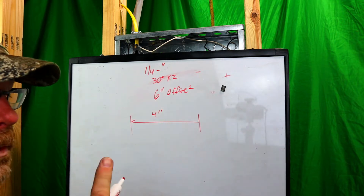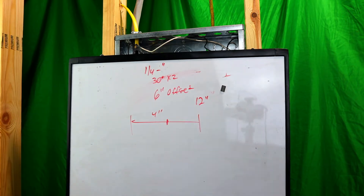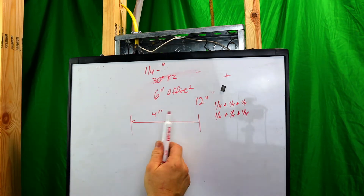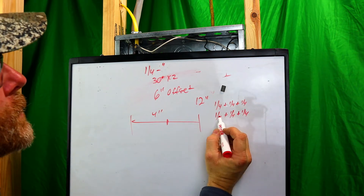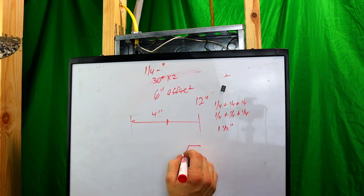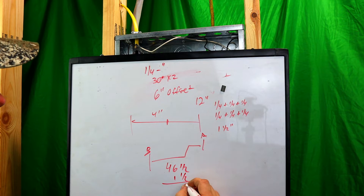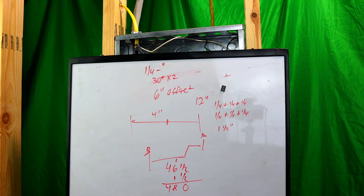Our multiplier: six times two is 12, so between the marks will be 12 inches. How much is it going to take off? A quarter inch per inch — quarter plus quarter plus quarter plus quarter plus quarter plus quarter. That's four quarters equals one inch, plus two more quarters equals another half inch. So you're going to lose one and a half inches off this four-foot piece. By the time you get your offset from point A to point B, your pipe is only going to be 46 and a half inches.